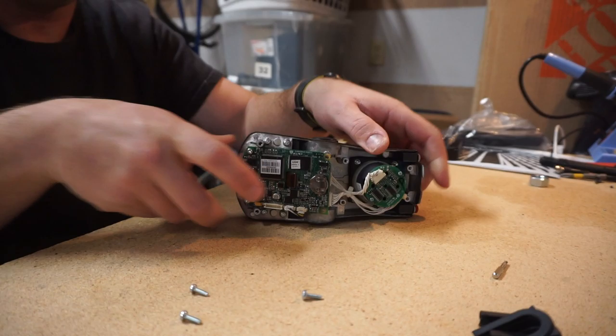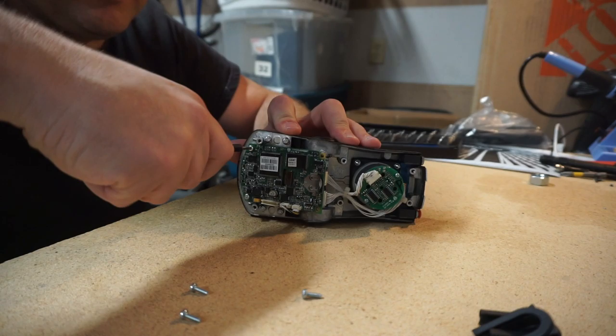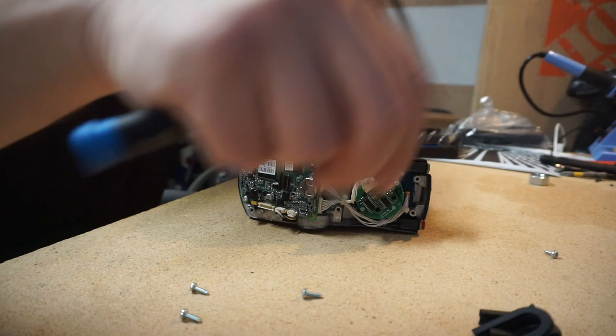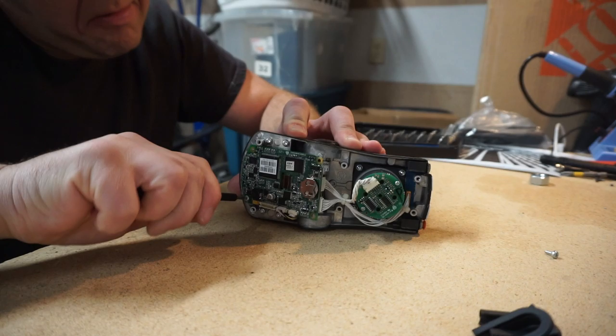I'm actually going to take this thing apart the rest of the way because I want to see what's in there. Normally you wouldn't want to use metal on this because you can tear your ribbon cable, but I'll be careful. This little latch here just flips up and then this cable slides out of the holder. We're going to take all these screws out on the corners and lift this board up and out. The screws appear to be different lengths, so make sure those are sorted into a separate pile — don't want to long-screw this thing.